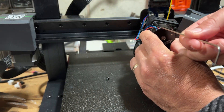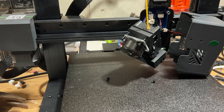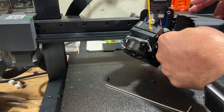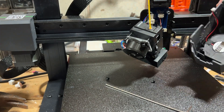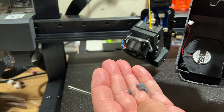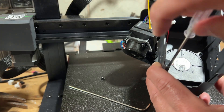Once those three screws are loosened, you can simply pull it out of the way. Now you've got easy access to remove that cable. I'm going to reach in here with tweezers to make sure I grab the connector and gently pull it straight out — you never want to pull it by the cables. When I picked that up, I had two little pieces of plastic fall out. I'm not exactly sure where they connect, but obviously they were connected somewhere. Now we just need a Phillips and we can easily remove those screws.